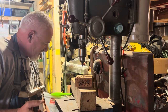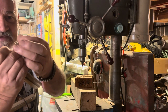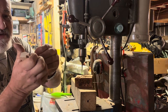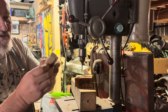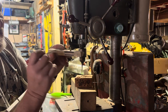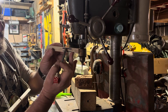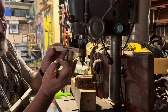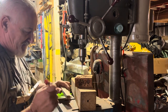With the Loveless attachment system, the quarter-inch piece — this is the Loveless bolt — it's got a little nut there and it is quarter inch. The first one I put all the way up, and that's what pulls the handle tight together when you epoxy it. As you can see right now, the nut is touching the handle, so I need to countersink that down to the bottom of this line.